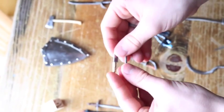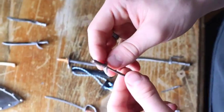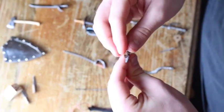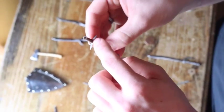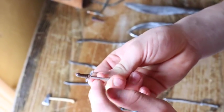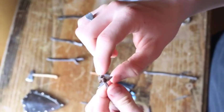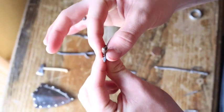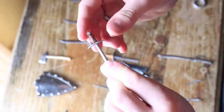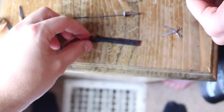The blanks were made from the nails — shaped through the nails and then the handles put on. For the handle, about the diameter of the nail in the middle, I drilled a hole through a piece of metal, filed the sides on it, then put the piece of metal with the drilled hole — same size as that — and hammered it on so it squished together and has a really good fit in the grooves. And that fits into this sheath right here.